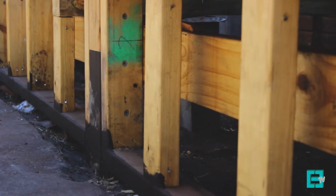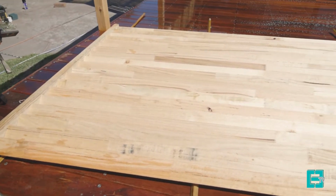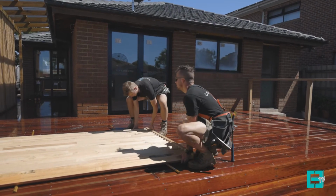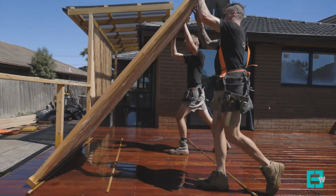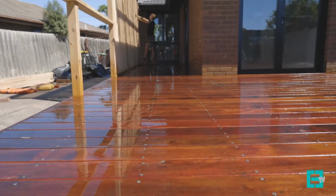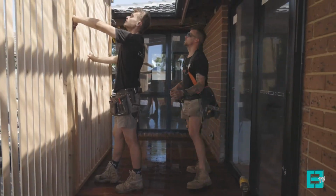To get a building permit, you will need an engineer to design the structural subfloor. If you are up to date with the regulations and familiar with the Australian Standards 1684, your building surveyor may let you engineer your deck to the requirements of the Australian Standards. Let's discuss some of the information I use when engineering and designing a deck.